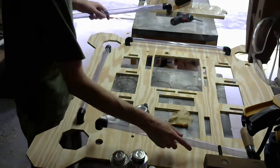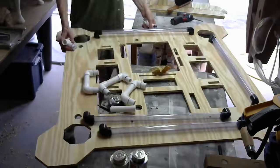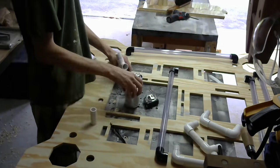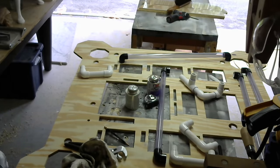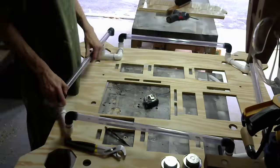Instead of connecting them, the loop is cut at the top right corner with the T-joint, and both ends are capped with the brass barb adapters. These 2 barb adapters are then connected with tubing that feeds through the pump. So when the pump is activated, it pushes the liquid around in a circle along the loop.